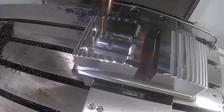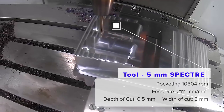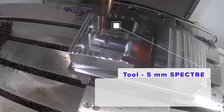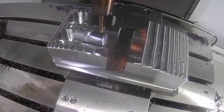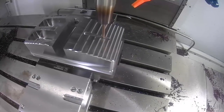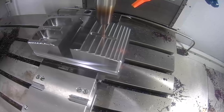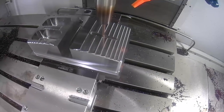And the Spectre — what's the Spectre doing? The Spectre is an extremely high feed tool that is producing the 7 millimetre slots in the middle of the path at the moment. It's a tool that we produce from 20 millimetres to 50 millimetres neck, and diameters from 2 millimetres up to 16 millimetres, which are sold constantly across the world in the die industry, producing a very high finish on every path.